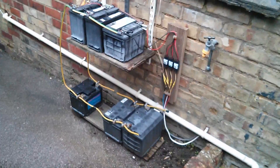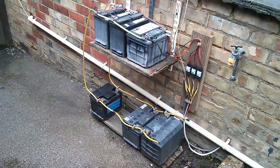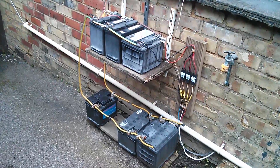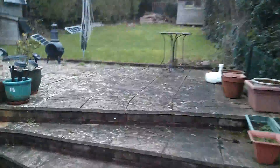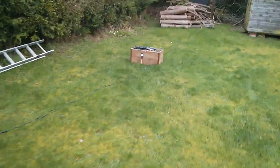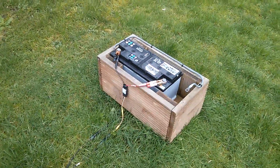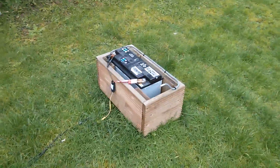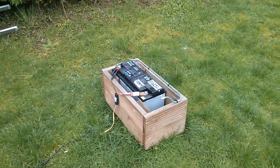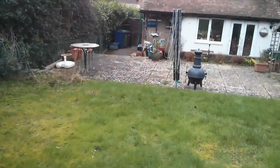The plan is to keep some batteries on the wall outside my workshop — those will be the sealed lead-acid batteries — so I'll have 12 volts directly accessible in the workshop. For the remote battery setup in the garden, I was thinking of having a panel and battery with a boost converter to raise the voltage, in a waterproof box with a wireless remote control so I can switch it on and off from the workshop. Then run some very low current wire at about 50 volts all the way back, and use buck converters in the workshop to produce useful voltages like 5 volts and 12 volts.